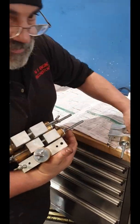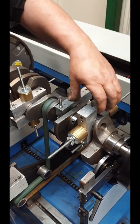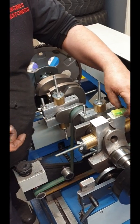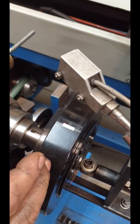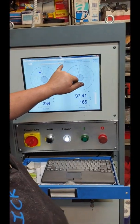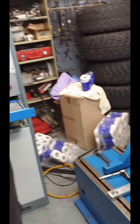I'm going to make half a bob weight which is 837.55. Let me grab that. I'm going to go next door and set this up now. So these are the bob weights as I spoke to you about before. We're going to pretend that we've got the two halves of the conrods on the big ends and one half of the piston on the top — that's what we made these for. I've already lined them up, I'll put them on top dead center, which I know is here exactly. I've got my harmonic damper with the weight and my plate with the weight, so I've got the measurements for a 383 Chevy and where I want to drill the holes.